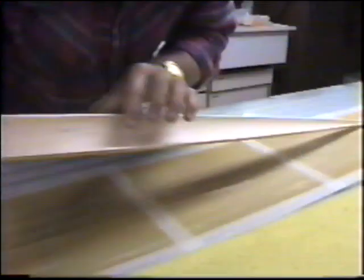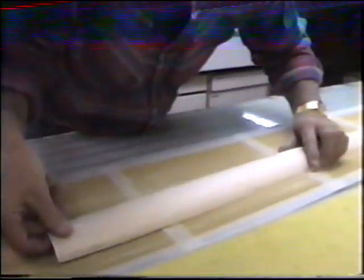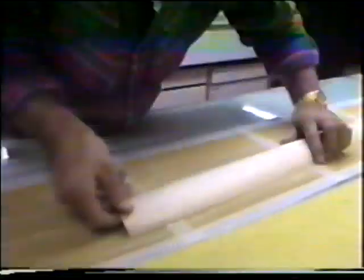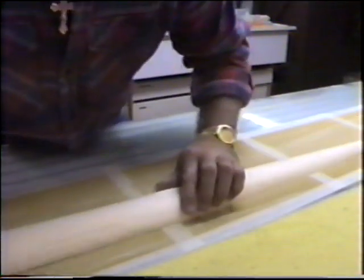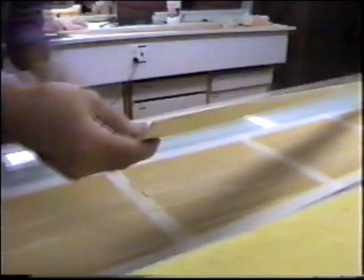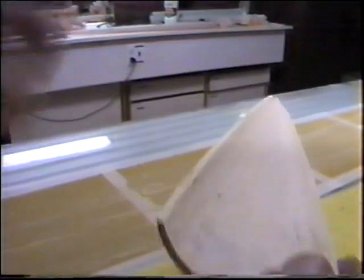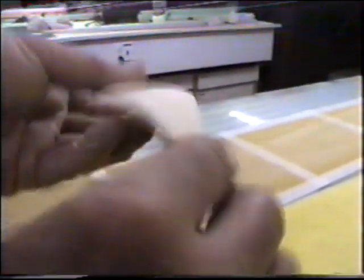Now, you want to look and see when you're just getting down to the very end, there'll be some last little chinks in it, but you sort of don't want to go any further than you have to. Okay, get a little look at how that came out. And you have a nice flat edge here now, that they're both parallel, because you've made them off the table. This is ready to glue on, and you have just enough of a little extra material to blend that edge in.